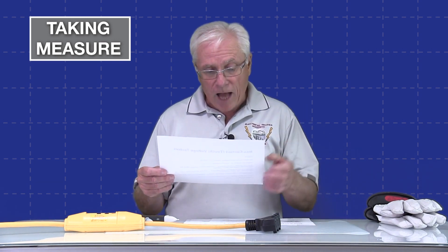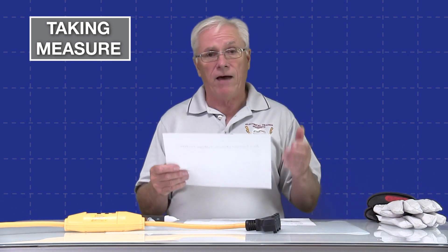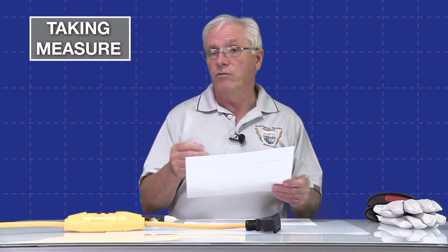So that may be problematic at times. One of these should not be trusted if you are trying to determine if a circuit is de-energized so that you might work on it. It is not acceptable for that, and NFPA 70E mandates you have to have an actual voltage measurement — not something like this — if you're trying to prove you have an electrically safe work condition.